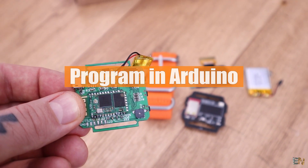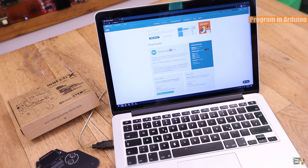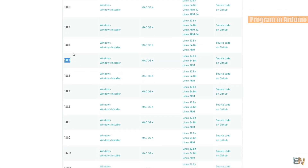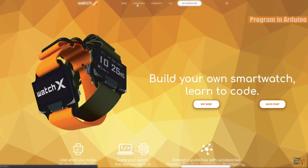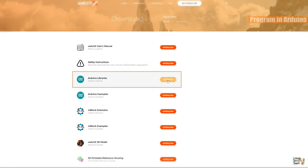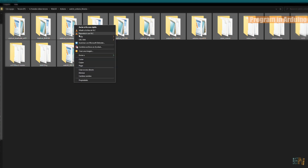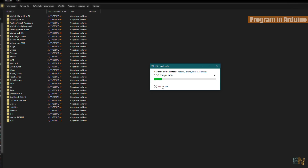Now, how can we use this board? First you have to go and download the Arduino IDE in case you don't have it yet. For some reasons the latest version gave me some errors with the WatchX firmware, so I had to use version 1.8.5. I downloaded the zip version because I don't need to uninstall the last version on my PC. The second step is to go to the link below and download the WatchX libraries. Extract the library zip files and copy all the folders. Now go to your Arduino IDE directory and open the libraries folder, paste all the libraries there, and if you already have one just hit the skip button. Now we are ready.